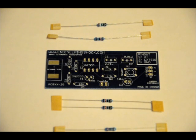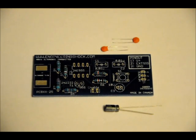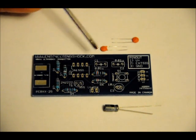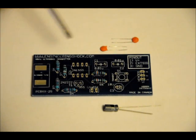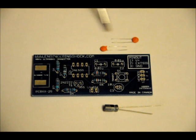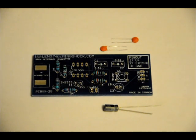Let's solder those into place, and then we'll do our capacitors. We've got two 10 nanofarad ceramic capacitors — 10 nanofarad is also 0.01 microfarad. If you look at the C1 and C2 slots on the top right, you'll notice 0.01u marked there — that's where these go. They're not polarized, so it doesn't matter which way you place them. For the electrolytic, however, polarity does matter.